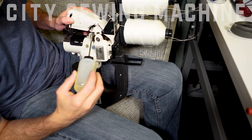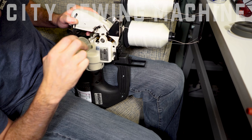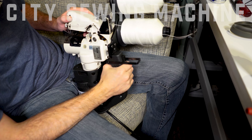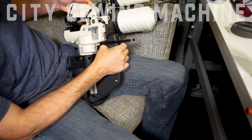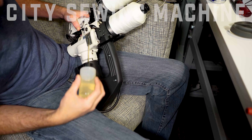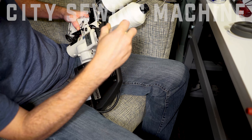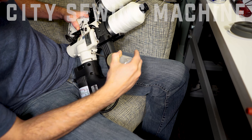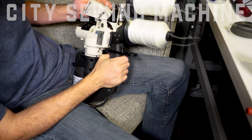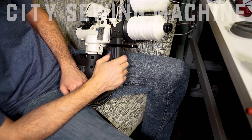Your ball joints here — just take a little drop on it, a little drop on the back side as well. It just helps give that particular part more life. Our other oiling points are here, here, and here. Depress the port, press it in, and give it a little squeeze.